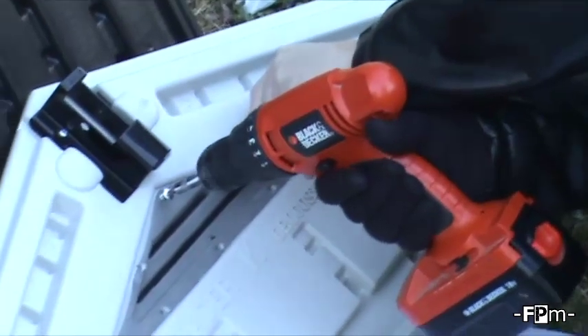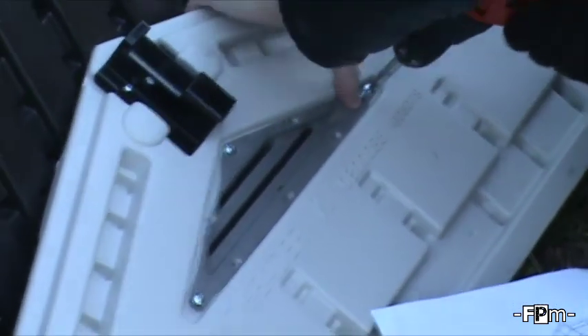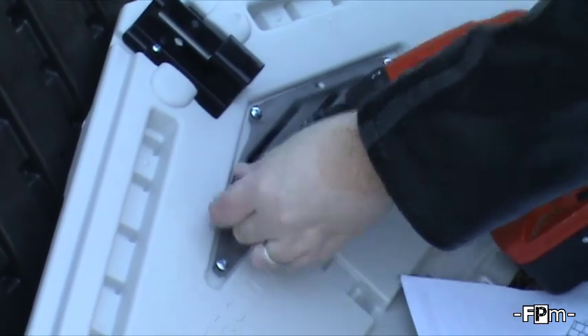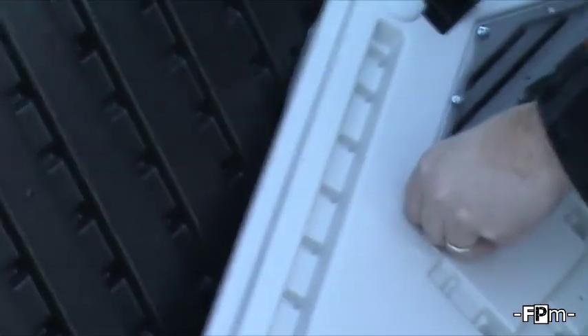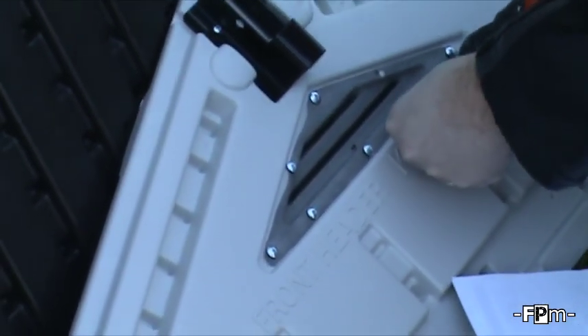The other major problem I had was with the hinges — they are just not intuitive at all. The instructions for them are really poor, and it took me a while to figure them out — that's one of the reasons we ended up going late into the evening. Good thing about it though: being out there so late, I found out my flood lights were working, so that was a bonus. The mesh is pretty straightforward — you just screw it on, but take your time because it's just a basic screen and if you screw it on too fast it will rip. It might even be better to use a regular hand screwdriver instead of a drill.